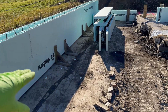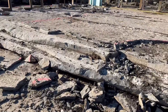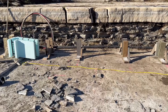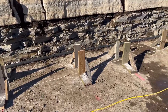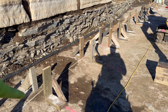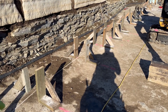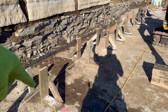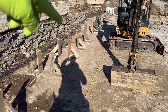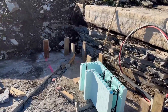What we're doing is I'm putting these wood blocks everywhere. You can see before the ICF goes on they're sort of everywhere, and I've got them strategically placed. For example, an eight-foot ICF will sit in between two blocks — those two blocks will catch the web that's 20 inches in from one end and 20 inches from the other end, all the way along. And then obviously places where you have a common seam, they're going to be staggered a little bit differently. I've got a few more on the corners to support the corners.